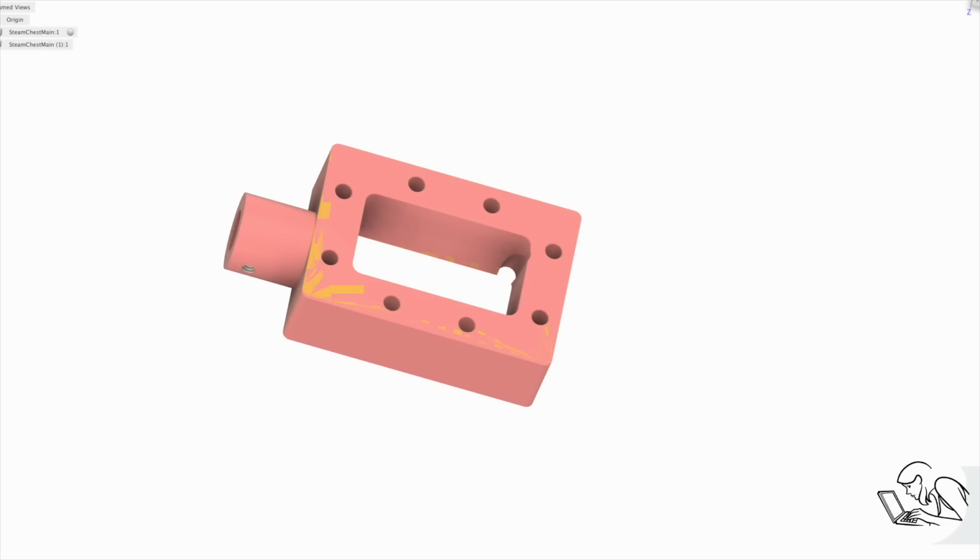There's still plenty of meat around those bolt holes, and the difference is certainly not enough that you can tell by looking at it in person that anything is undersized. Furthermore, by removing the material just from the outside of one edge, I can preserve the references of the steam chest. Here's what I mean by that.